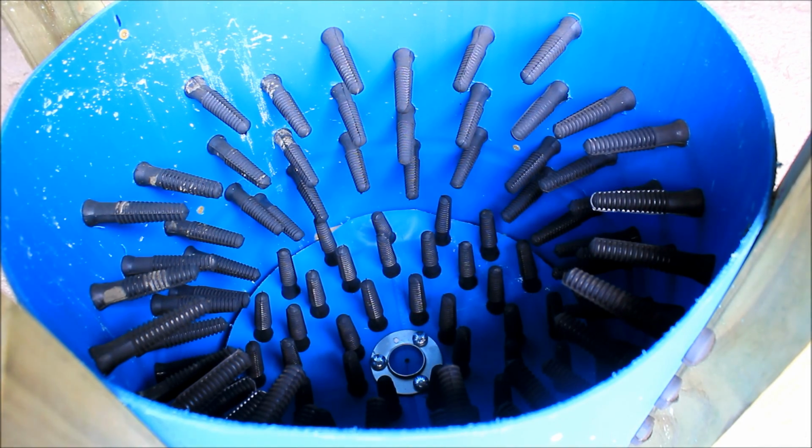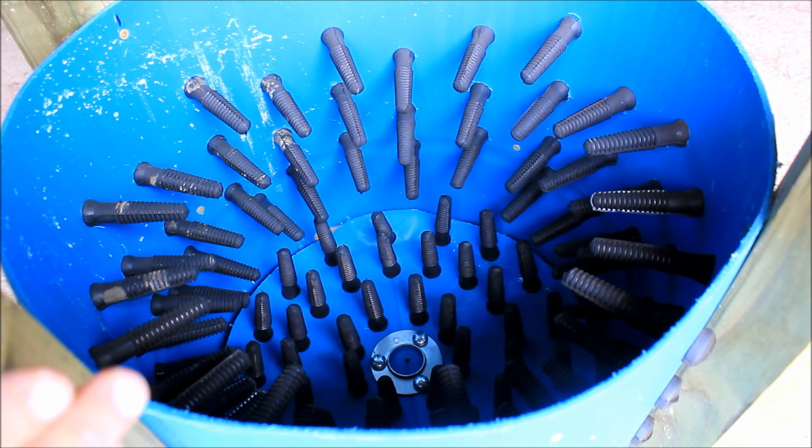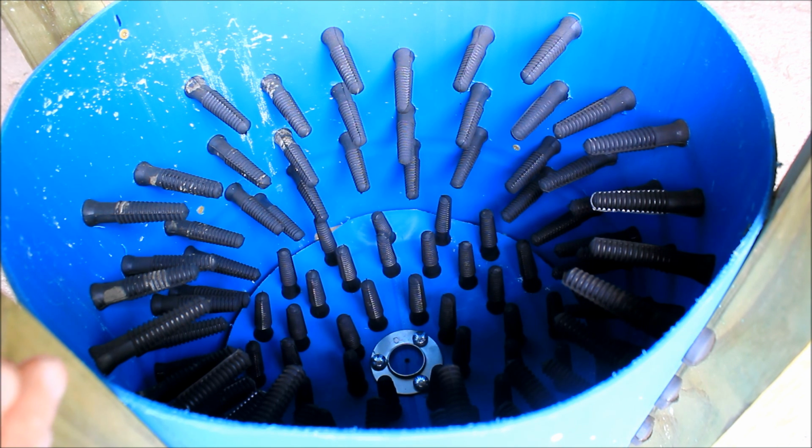Alright, so I got you set up here real close. This tripod I have out here in the barn is a little shorter than the other one, so you'll be right up here in the action. Alright, so again, let's review. What I had before was a 1/4 horse motor with, I think, a 2.5 or 3-inch pulley. And what we switched to was a 1/3 horse motor with a 1.5-inch pulley. So that should really reduce our speed and make for a better gear ratio.